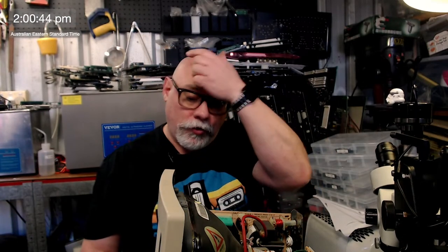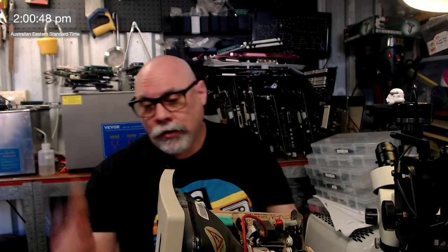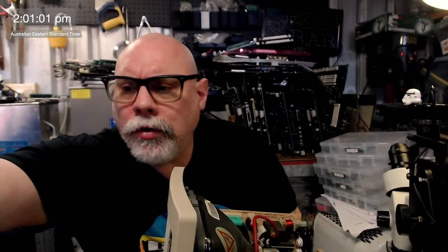This live stream was as advertised. I've recapped the analog board of a Macintosh Classic, and it's working well. We're getting nice stable voltage from it. We're getting a nice sort of stable image from it. Got it all fixed up, the geometry, got the focus all working, and it all looks great. Is it just me, or does this camera look like it's on a tilt? Oh yeah, the monitor's all wobbly. I'll fix that.